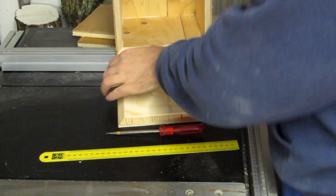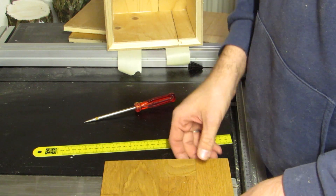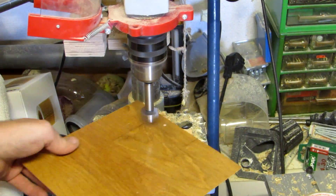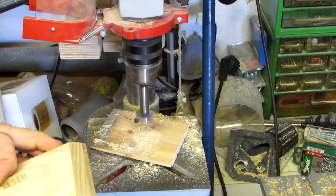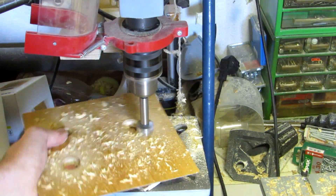Then I remove the face part from the glue-up — the one that I didn't glue in place but used for alignment purposes. After trying to make some marks on it, I just decided to go wild on the drill press. Here's where the actual carving takes place. I'm using a forstner bit — I think it's a 20mm one — for the eyes, and then I make a few holes for the mouth.